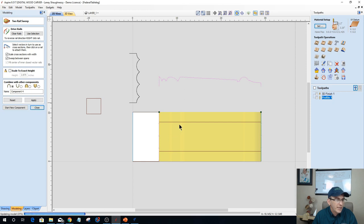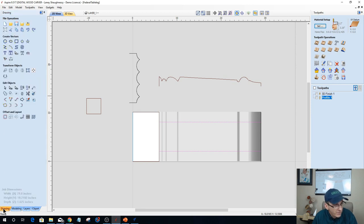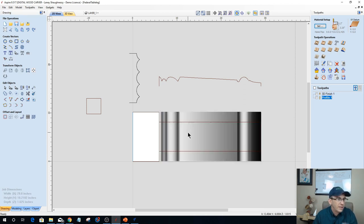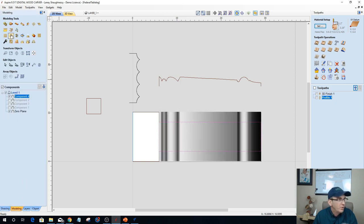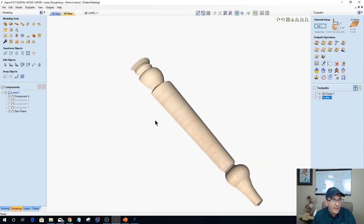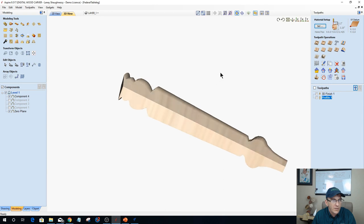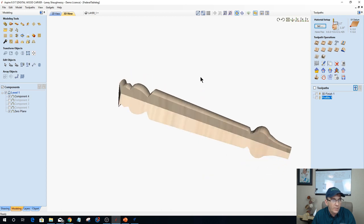Okay, let's take this vector and let's join those vectors with a straight line, and selected my model, select this vector here. Keep holding the shift key there, Lainey. And let's remove everything outside of the selected vector. What we're basically doing is creating, it's only wrapping a certain distance. You see that there? Around the cylinder, it's only wrapping a certain distance. That's what I'm doing by removing that model. It's not wrapping the full 360 degrees.